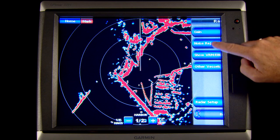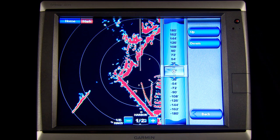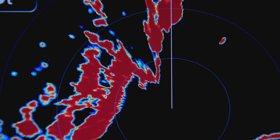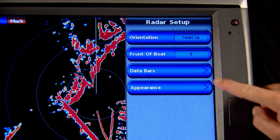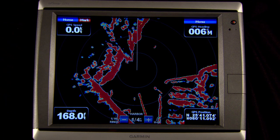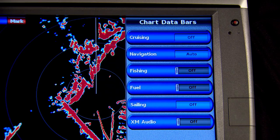Let's dive into the radar setup menu. For the front of boat offset, you should only need to adjust this if the radar was physically mounted slightly off-line — line up the boat on a fixed radar target and compare the target's position against the heading line, then dial in a few degrees of offset if needed. The data bar option lets you turn on, off, or change the data shown in the four corner boxes, or add more data bars like fishing data, fuel burn data, sailing data like wind speed, and XM data if available.